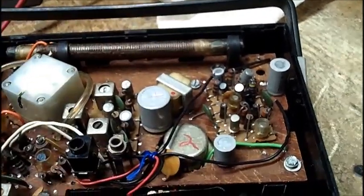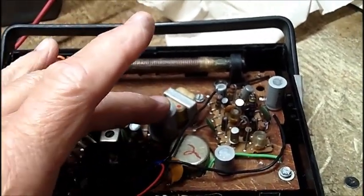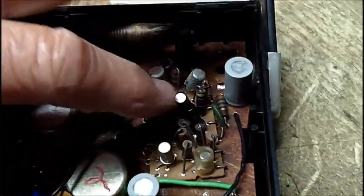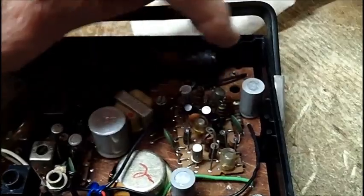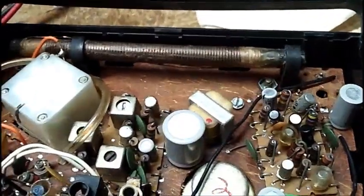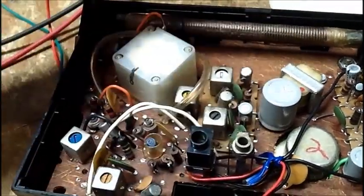It appears that it'll all come out in one piece, except for the speaker connections. I may, off camera, replace these three. I didn't realize, but there are two or three electrolytics on this board. I cannot deal with that — I will not change these, because that would involve taking the board off and I'd end up ruining the radio. So I replaced this electrolytic, this one and this one, and that's it. There's one on the other board over here I won't be able to replace.